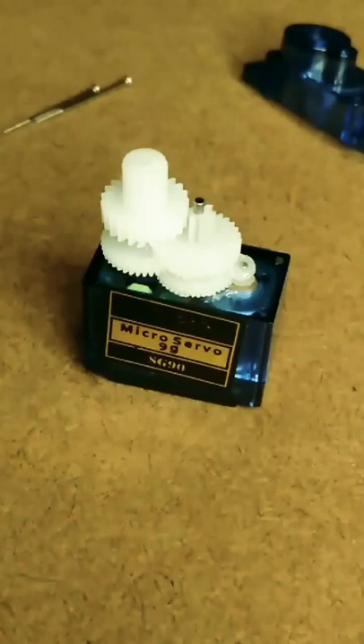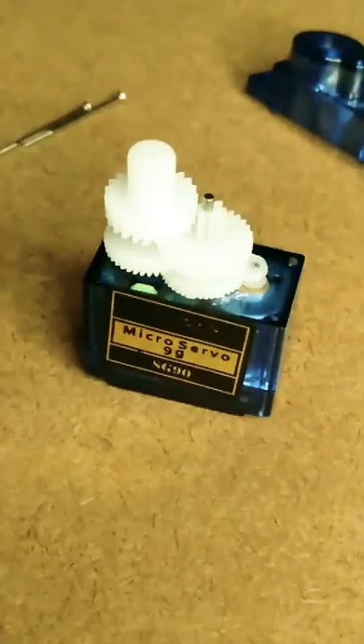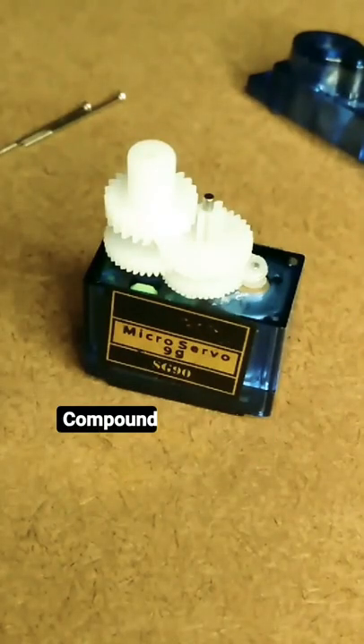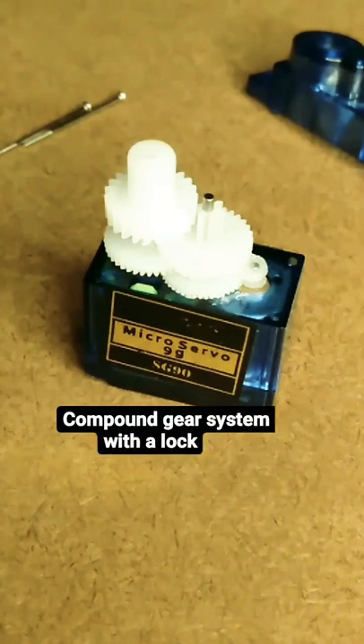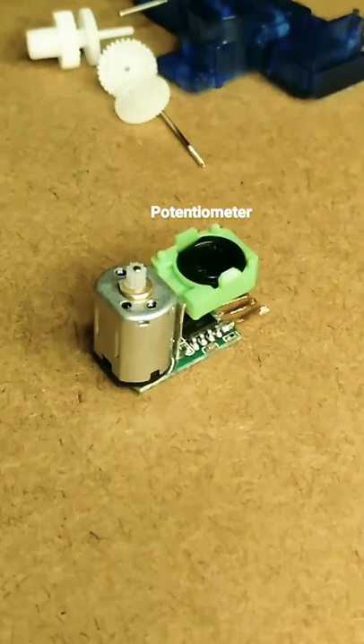As you could tell, the motor being a 0 to 180 degree rotation type is a feedback control servo motor. At the top frame it consists of a compound gear system with a lock pin. The bottom part consists of a potentiometer, a DC motor, and a control circuit down below which adjusts the pulse width using feedback from the potentiometer.